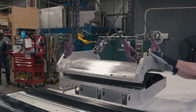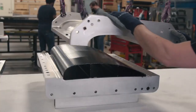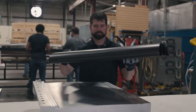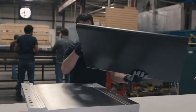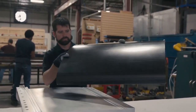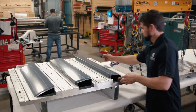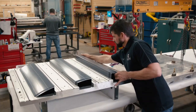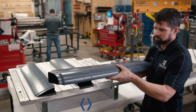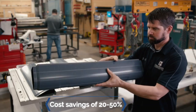Using the combination of techniques shown in this video — including smart tooling, low-cost raw materials, and resin transfer molding — enables the design and fabrication of low-cost composite parts with structural integrity and weight neutrality when compared to conventional prepreg and autoclave cured components. When comparing the Hawthorne method of manufacture to the industry standard of prepreg and autoclave cure, we commonly achieve cost savings of 20 to 50% over the baseline.